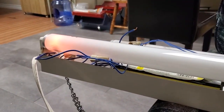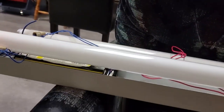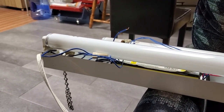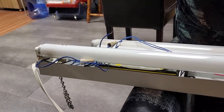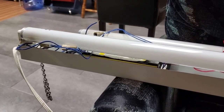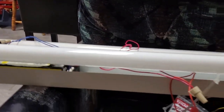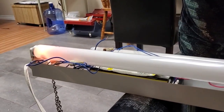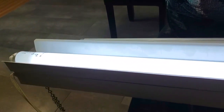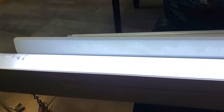Interesting, why isn't it starting? It should have started very easily. With any rapid start ballast, magnetic or electronic, you really need a good grounding source across the lamp to help ignite the arc. I have the cover off of this fixture right now, and that's probably why it's not getting good enough grounding to start. Let me put the fixture cover on really quick and see if it'll start. There we go! Kind of a nice color from this lamp - it looks mostly like an ordinary daylight, but Daylight Deluxe has a better color rendering. I started this lamp nicely once I gave it a grounding source.